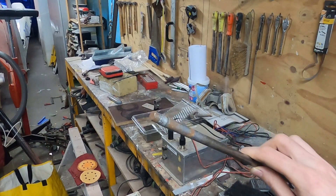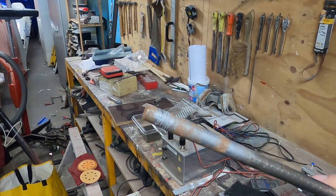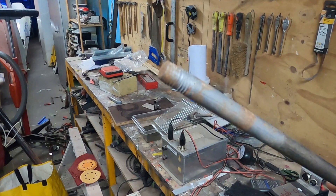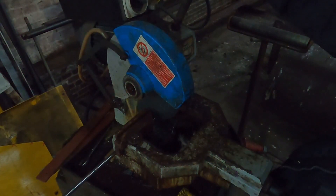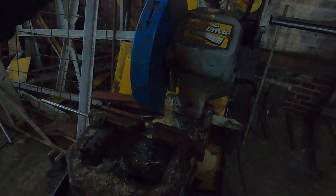The original axle that came with the plane is not in great condition anymore. Although it's strong enough and not very rusty, most of the threads on the end are stripped off — certainly not enough thread to fulfill the two-turns-of-thread-after-the-nut requirement. We therefore decided to make a new axle out of a longer but slightly worn-out-at-the-ends other axle that was available in the workspace. Thanks Peter — this really helped us out a lot.